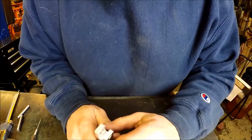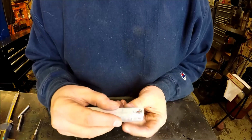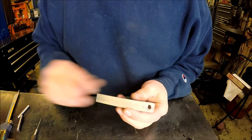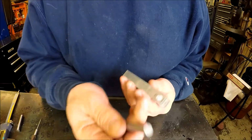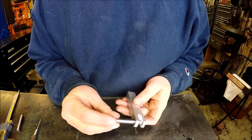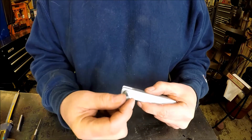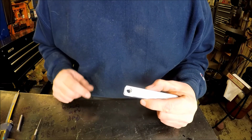Well, Houston, we have a little problem. So here she is. I rounded the corners, but as you notice, that drill bit walked going in. It's supposed to be an 8 mil drill, which comes out to 315 thou. Here's a 315 thou gauge pin. So as the drill bit was going through and coming out, she's fine. But look how much you've got in there. You say holy macaroni. So yeah, that drill bit seriously walked.